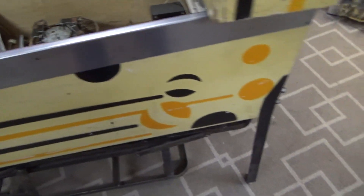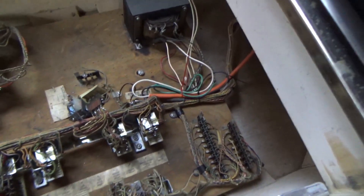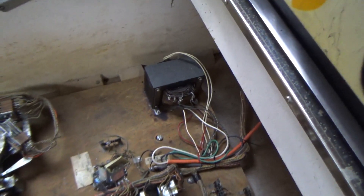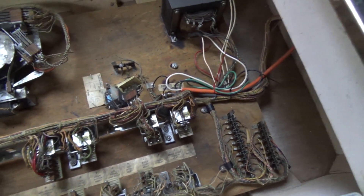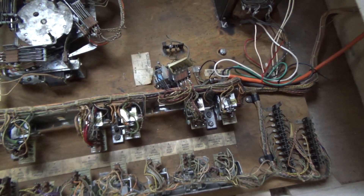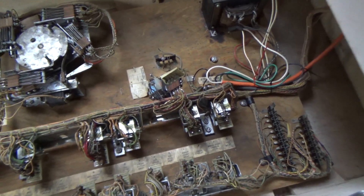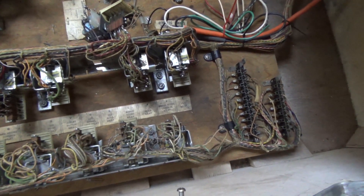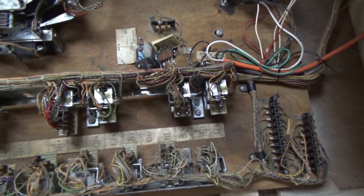I have popped the playfield out of it — we're going to get down to it. I've started going through cleaning the switches. I'll show you what we're looking for when we do this — I use a little file, not super aggressive, just a really mild file to clean off the contacts. You want to go through and basically clean the surfaces of the contacts. Back in the day they used like a little piece of a business card or something, but these things are filthy now — you're going to have to do something else.